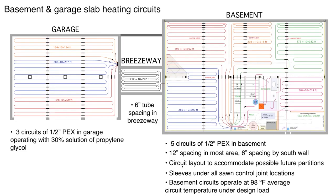Regarding mechanicals, here's the floor tubing layout for the basement. Starting over here on the right, it's a pretty simple layout with individual circuits — all half-inch tubing. We laid this out starting from a manifold that is in the corner of the mechanical room, in the north-central area of the basement. The manifold is located here and you can see the circuits go out.